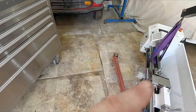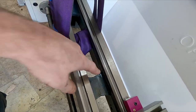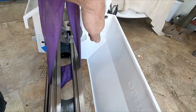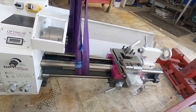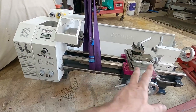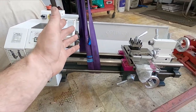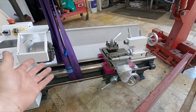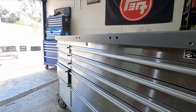If you're interested in lifting it the way I am, this is where you need to hook it up. There's a ribbon side here just like this one. You want to go under the inside and then out on this side, which is the backside of the lathe, and then under and over on the next one. It's the closest center of gravity I can find — there's a lot of weight here and it's really long, so it's almost 40% to one side. I'm just going to lift it up and put it on this box here as temporary. My toolbox turns out to be almost exactly the right size.